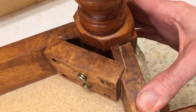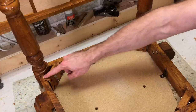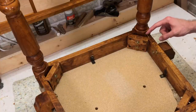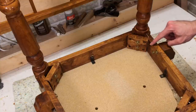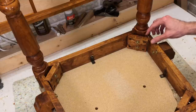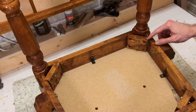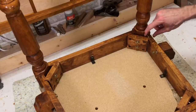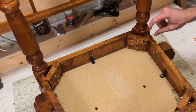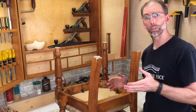What I'm going to do is glue these two broken pieces back in place so they're in the exact same spot. Then, using the surface area here, I'll shore up this piece of wood to get it strong enough that it will not break off again in that direction. The very first step is to glue this back in place the way it originally was. Now before you glue something together, you should always dry fit it first — put it together without any glue on it.